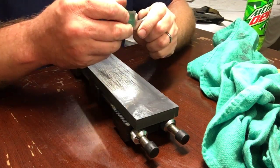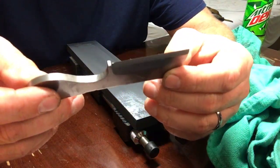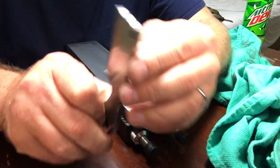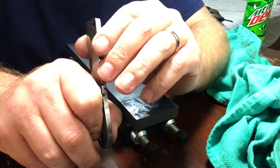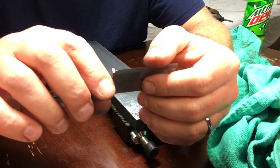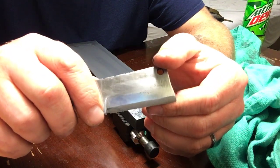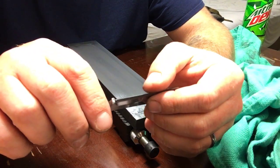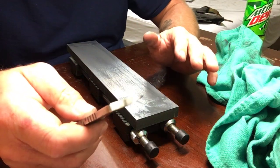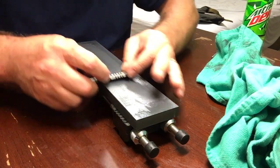And one thing, a lot of you on here experiment with making knives. This is somebody else's design, and I'm not knocking it. But that's pretty thick stock, 3/16, I believe, and that's a really small blade. In order for us to get it to cut halfway decent, we're having to make a really wide bevel here. So in my opinion, thinner stock for something this small would have been more appropriate. But again, I'm not knocking it. It's not my design. I'm sure it'll do well.